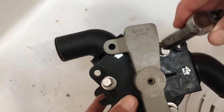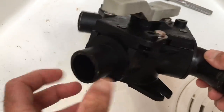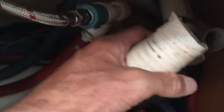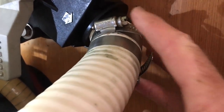First things first, we're going to screw the unit back together. Now we'll reconnect the hoses before we bolt it to the wall, just so we have a little movement because the hoses are going to be tough to get back on. I had a look at the hose and although it's a little dirty, there isn't any calcification in these areas - I'm pretty happy about that. I don't have to bang the heck out of them. That's one bit of good luck. Overall it's gone really smoothly - exactly the way it has every other time. I've reattached the screws. Now I'm just going to tighten the clamps. A good rule of thumb with hose clamps is to always have them opposing each other instead of on the same side.